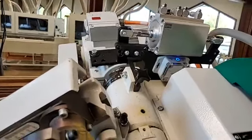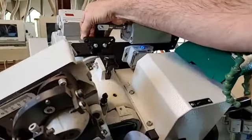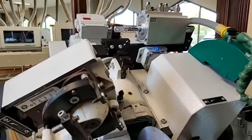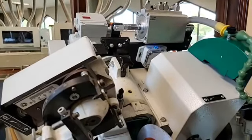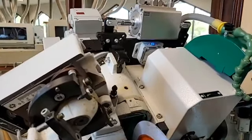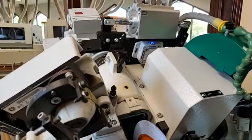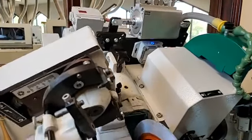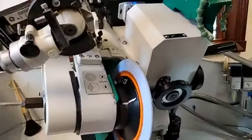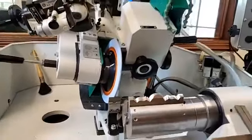So the good part about this is, with the pins, we can mix and match. If we've got one side of the knife that is very thin, let's say we're getting down into a groover or something along those lines, we can come in and set that value. But then I also want to take more off of the other side because there's a lot more knife steel supporting that other edge. So I get a lot more clearance out of there. More clearance equals more cooling and a sharper tool.